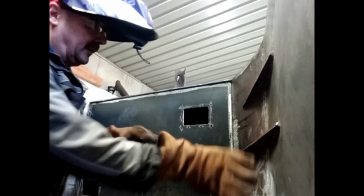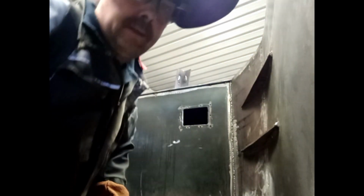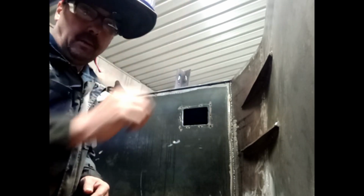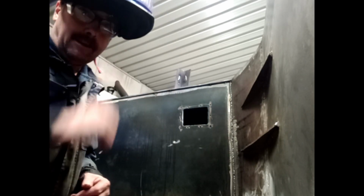Up that vertical. We're going to get the root up that one now, then the cap. A very fine small weld that goes all the way up and pierces through to the side, and now there's a fill all the way up, so you have to adjust the power again, get a bit more power this time.